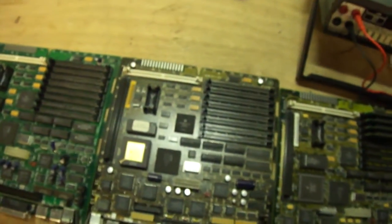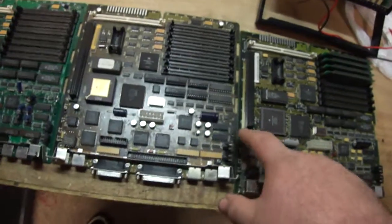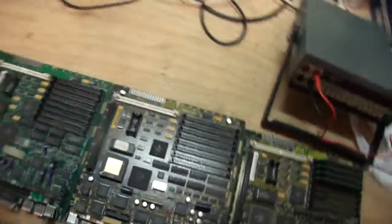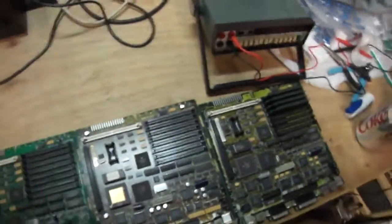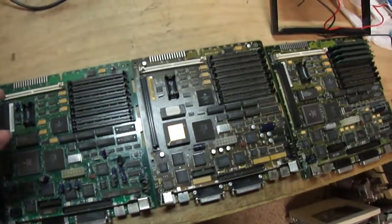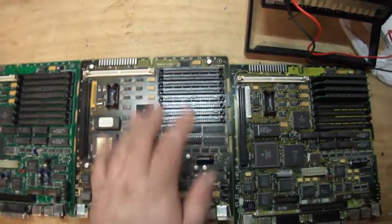That's why I got this board; otherwise the original owner would have just attempted to recap it himself. We've got two blown Q1 and Q2, which actually form the output transistors to drive the internal speaker. Luckily I grabbed a couple of brand new ones before I left work. I'm hoping the op-amp, which is a TL071, is not bad, so I can just fix this board up and make sure it works.